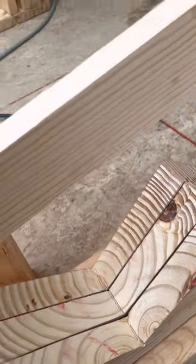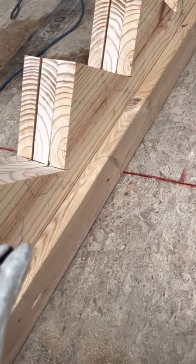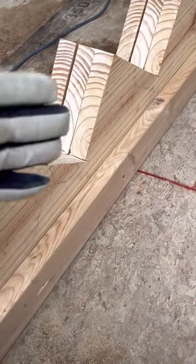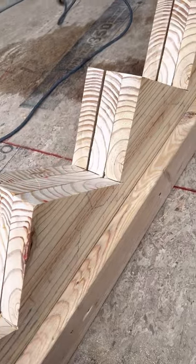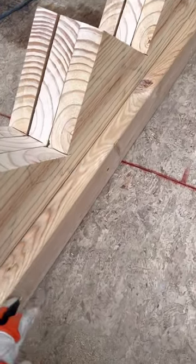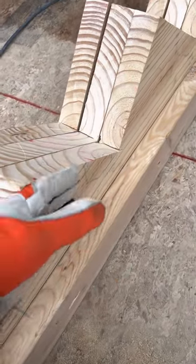But the point is, using this 2x4 on the side of the stringers is deliberate for the finish that we're creating. So I know it's going to be 1/2 inch drywall. I know it's going to be a 1x12 trim stringer on the side of here. So we're just setting it up for that. If there was not going to be a trim stringer, I would only put a strip of 3/4 on here, and that would leave enough room just for drywall to pass by.